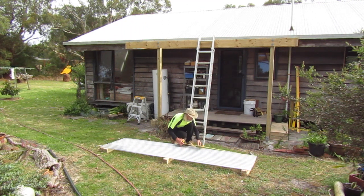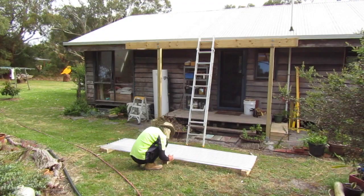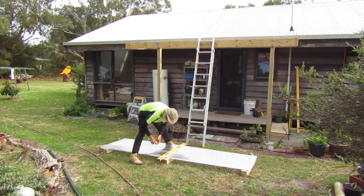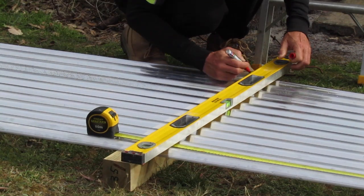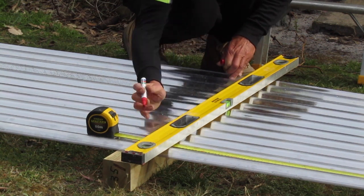I'm now ready to install the polycarbonate roof sheeting. It comes in pieces over double the size we need, so I'm going to start by cutting the sheets in half. My client's not sure how much overhang she wants on the awning, so by cutting them oversize and putting a piece in place, we can come up with a formula for what the final cut will be later.